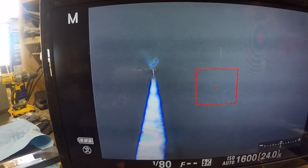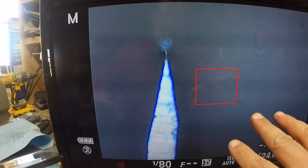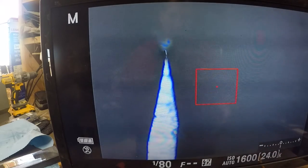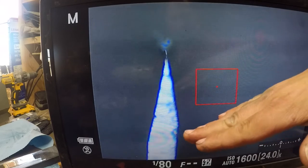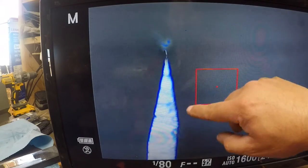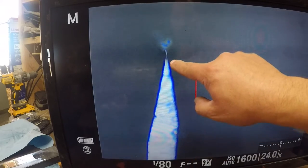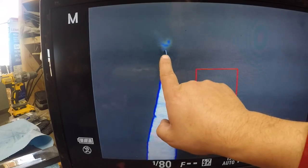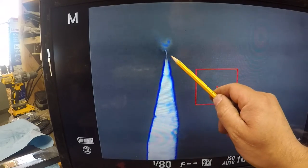We've got most of our shaping done. If we were trying to create the absolute perfect edge we could lay our edge angle down a little bit to grind this farther back. We'll go ahead and go to the fine stone — lay it back some, try to even out the bevels — and then grind on the other side so we'll be able to move that burr over. The next time we look, this should be farther back and that burr instead of laying over one way should be laying over the other way.